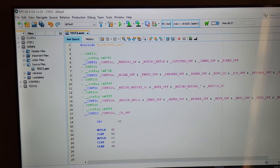Okay, good. So when I cleared 13, I set up the IO port as an output port, because every zero on every bit represents an output, as you know from my last three or four videos. And then on this particular chip anyhow, register 13 was actually setting up the port, and register 0D is actually where you put your contents on the port, or on the IO port.